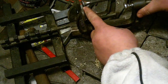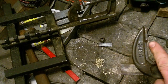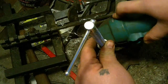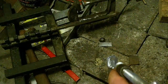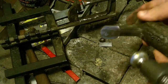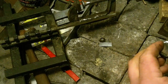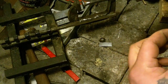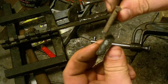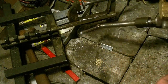Before I get it mounted, because I want the two ends to line up the same, I'm going to grind this clean and weld a piece of flat stock on the end just to give me clearance from my bar. This is actually two pieces — they weld together to give me a little bit thicker. So we'll get this welded on here and then start lining it up onto that one.